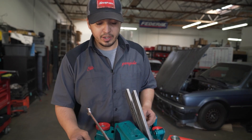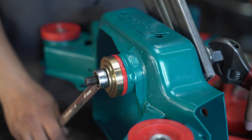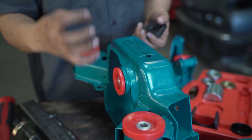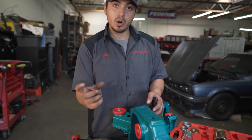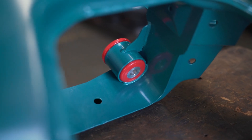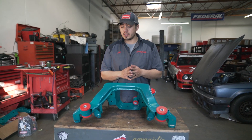I've rigged up a little tool here just to get the bushing pressed all the way in. You can see the gap is closed. Now when you back it off, it is gonna open up a tiny bit — you can see it there. The bushing is tapered, and that's on purpose — it adds more strength to the lip, and that's why it gets pushed back in a little bit. Once it's installed, it'll probably stay there, or it'll go in just a little bit more. There you have it, easy peasy.